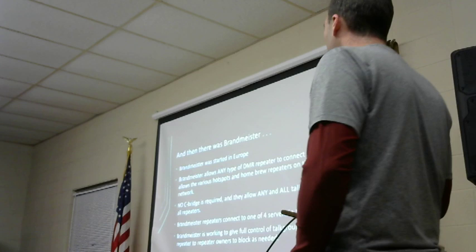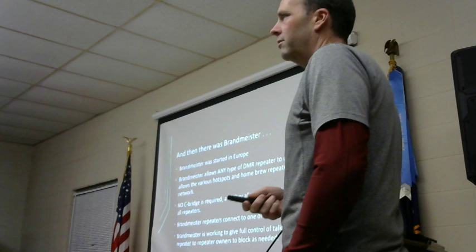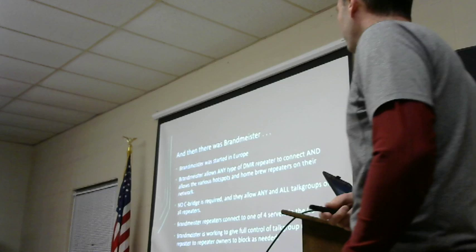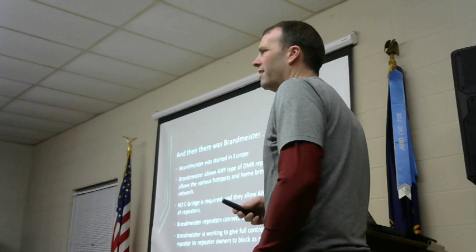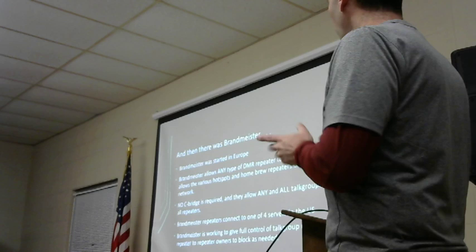So Brandmeister came along. It started in Europe, and it really started taking off probably two years ago now. It allows any DMR repeater. You can have a homebrew repeater with a Raspberry Pi as your controller, or you can buy a Hytera repeater or a Kenwood repeater or whatever repeater you want, and it will work. You don't have to have a C-Bridge. The C-Bridges are about $1,500 to $2,000, so that's another benefit of not going with the MARC connection. Brandmeister also offers some redundancy. There are four servers in the US alone that the repeaters will generally connect to. And they also allow hotspots.